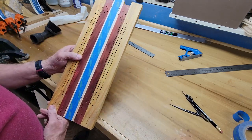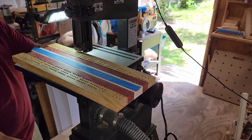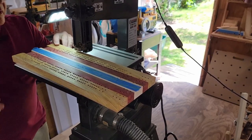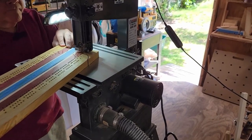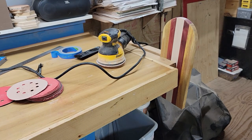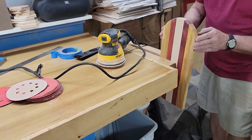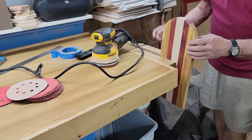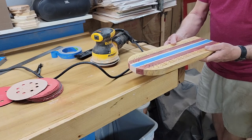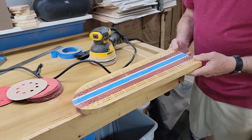So I've got my arc. I know that I can cut on the bandsaw. I have my two-stage dust collection system all set up, my bandsaw set up and ready to go. I'll put a link up above to my video on my two-stage dust collection system. This is a small shop so I have to move things around to get to the next piece in the process. I've just sanded the top using 100. Now I'm going to begin sanding the finished piece - I'm going to go to 150, then 180, and I finish off with 220.